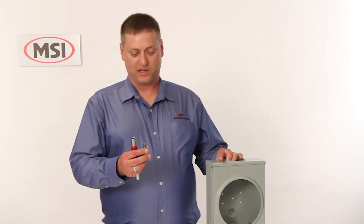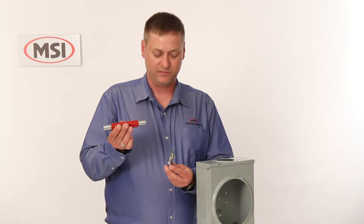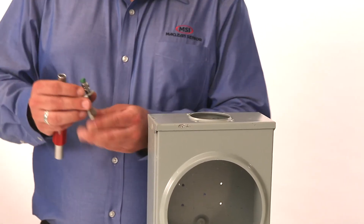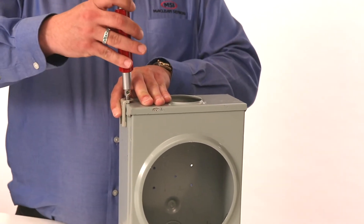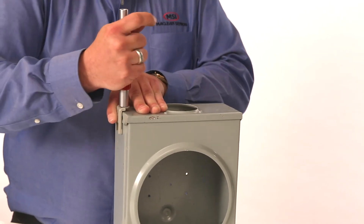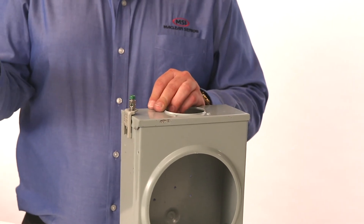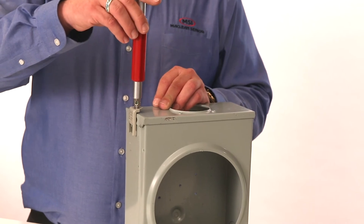To demonstrate quickly the side lip meter box clamp — single tool installation. You want to go ahead and use a 7/16 to open up the clamp, attach it to the side, and go ahead and hold it in place. Use a 7/16 to tighten it down and that patented screw will cut through the paint and seal at the same time. It will not walk on you as you do it. Then you can take the 3/8 side of the can wrench to attach your ground wire, and again it will take up to a number six.